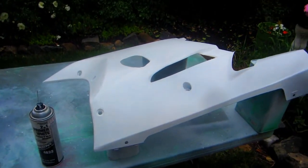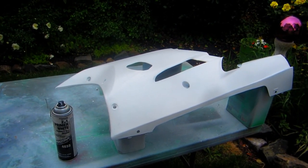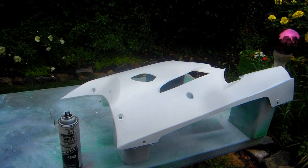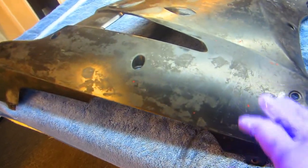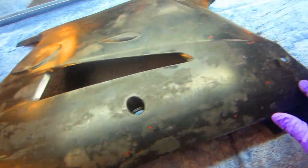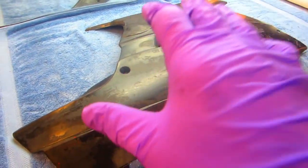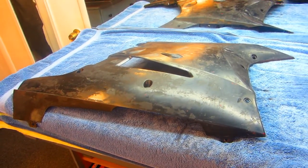I've got a second coat on. I'm not real happy with that primer — but the customer is always right. They say let it dry 20 minutes before you sand it, so I'll go over and spend a little time getting the other part prepped. It was roughly a two-hour job to get rid of all the residue from the paint remover and those giant awful scratches on these parts. I'm not having good feelings about that white primer, especially the way it sprays, but while it's drying I can get a start on this next part.